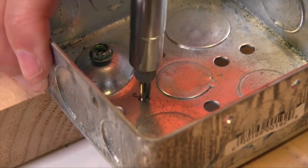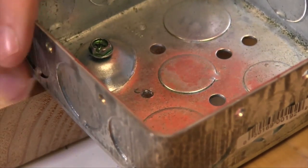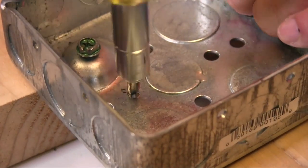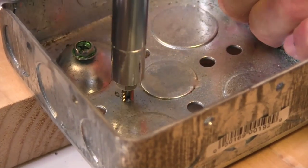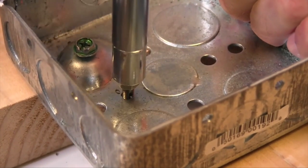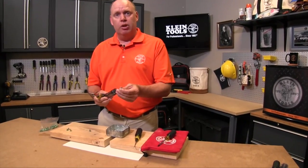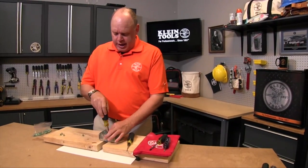One of the things I'm going to do is back it off, remove it, clean off any of those metal shavings, and then continue on. Very often people start feeling resistance and keep threading — more resistance means it's cutting the hole, but it's also damaging the tool. The result can be something very similar to a broken tap like this.